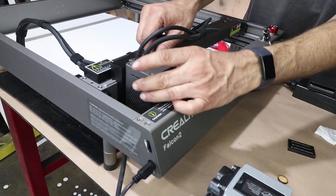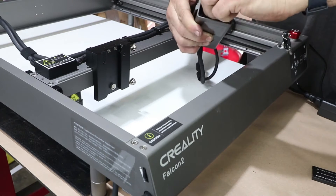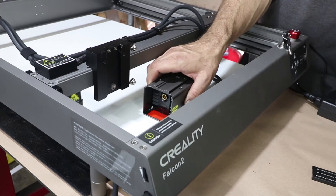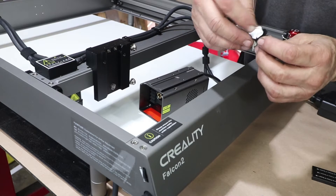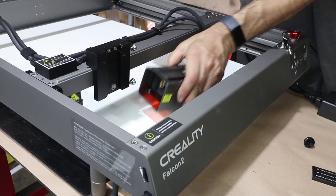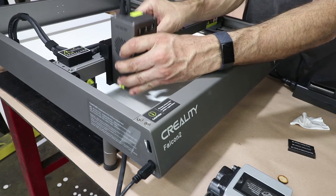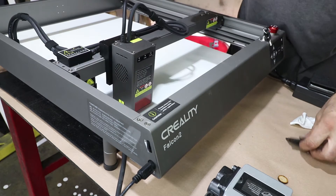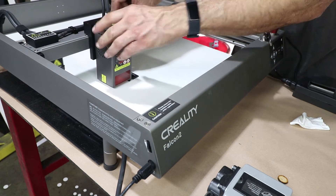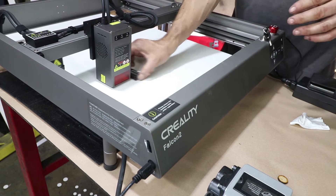Just make sure you switch it off. Undo these thumb screws here, and then this guy just unscrews — it's got an O-ring in there so you need strong fingers. I typically use this special lens cloth and just wipe out the inside, because there is a little bit of residue in there. Then I get a nice clean section and wipe the lens. Each time you clean the lens you do have to reset the laser depth, which is pretty easy with this little gauge. Move it to the center, put it underneath, let it drop down on top, and support it while tightening the thumb screws. And that's it.